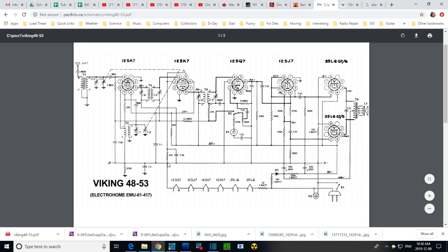to the B minus. There's going to be a capacitor. It's going to be up in here. Sometimes they put a filtering capacitor literally right across the power line here. But I don't see anything like that in here. It would have to come down to this area here. So I think there is no such capacitor across the power.